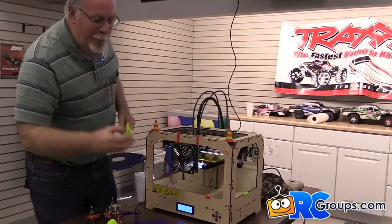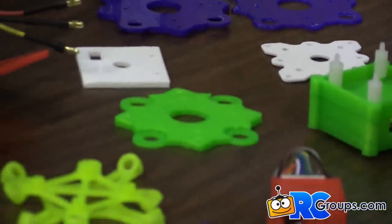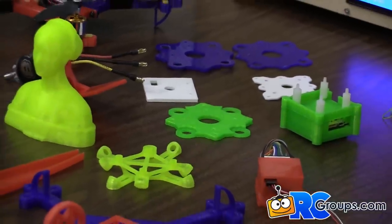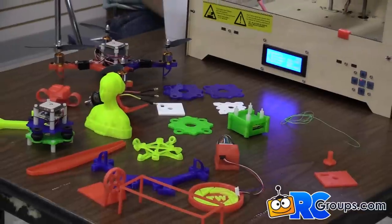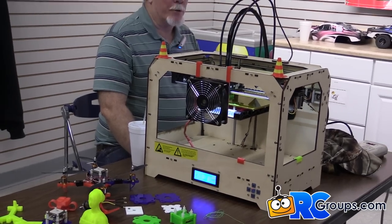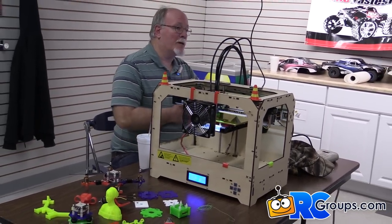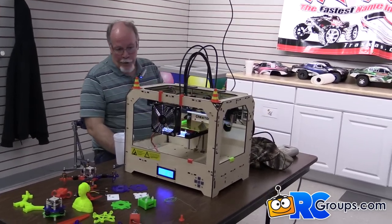This particular piece I build with the supports on. The first couple times I tried it I got melted blobs because without supports it couldn't span the gaps. There's also a thing called rafts, which is kind of like a pallet laid down before the model prints. Again, PLA is really hard to get those off; ABS comes right off. Most things I print I try and make them flat so I avoid needing supports.